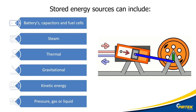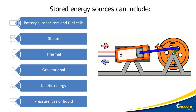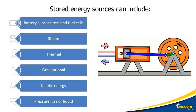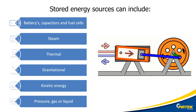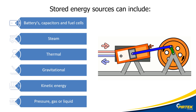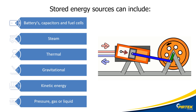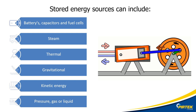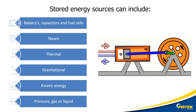Kinetic residual energy: is the flywheel still rotating after I isolate the primary power source? Pressure: we already looked at the compressor example. Chemical: as with my lawnmower, make sure the primary fuel source — the two-stroke — is cut off, and also remove the spark plug lead. You wouldn't clean or service a loaded nail gun, for example. First, remove the energy source — the battery or cylinder — then remove the nails.